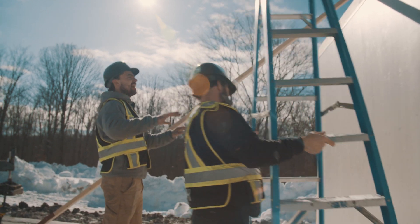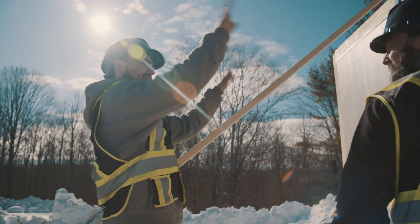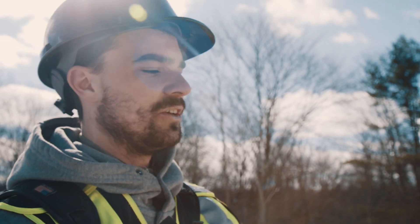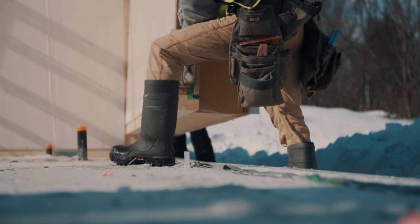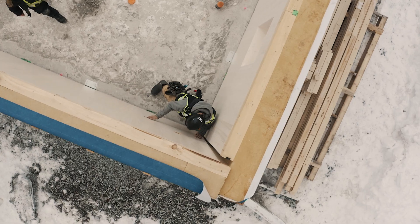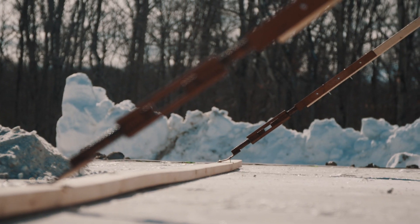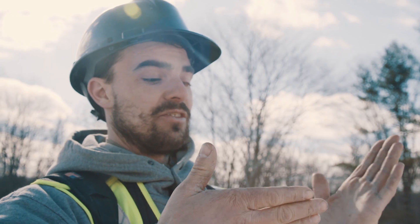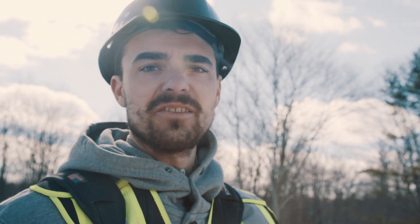We'll put the bottom in first and leave the top out on level, and then we'll pull it in. What we usually do with our walls, especially on corners, is we actually set it off level when we land the wall. These braces are adjustable so that when the wall comes into the corner it allows us to pull both walls together and then attach them nicely.